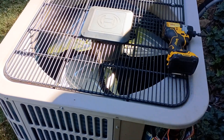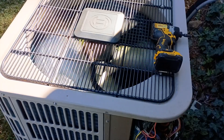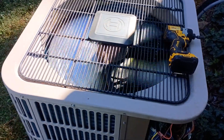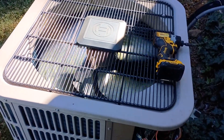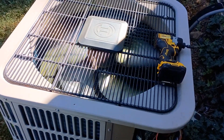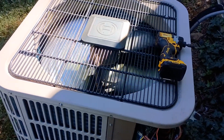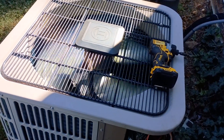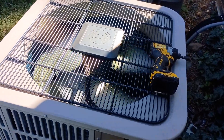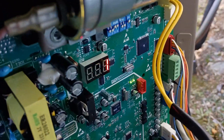All right, there we go. So that was the process. If you heard something like that happening on a regular heat pump, you'd think, what the heck is going on? But you heard how that thing ramped itself up — you heard that compressor really kick up in sound, then it slowly started going back down, then it kicks off for a second. You get your reversing valve shift, we re-energize the reversing valve back into heat, the fan kicked back on, and we're done. What — a minute or so there? Didn't take long. But that is the defrost cycle on one of these.